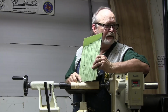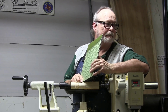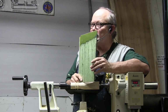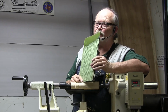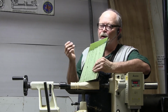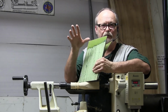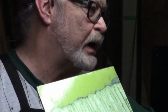I will show you something. Oh, it's not a scraper. Yeah, but I will show you something about it. Here's some photographs. I did a study with crucible steel. These people invented powdered metal. Powdered metal is one of the biggest innovations of steel in 100 years. It happened in Syracuse, New York, believe it or not, late 60s, early 70s, where you turn the ingredients of steel into flour. And then they blow it through extremely high temperatures, put it into these giant casks under extreme pressure, and they were able to make alloys the world had never seen because nothing settles out.